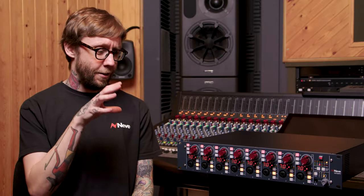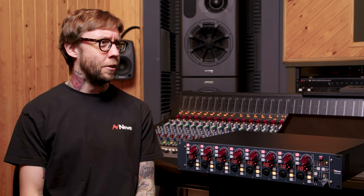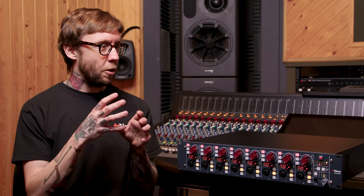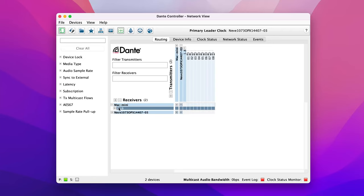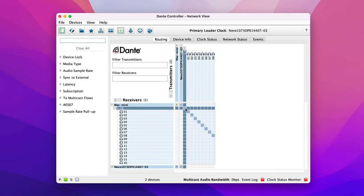The ability to place eight high-end preamps anywhere in your studio is going to be massively beneficial. Because Dante uses Ethernet cabling — your existing infrastructure in your building — you don't have to have many specialist cable installations to get this working. This means you can have essentially multiple OPX units connected through the Dante network, whereas with the USB ADAT card you're limited to up to 16 preamps through a single USB connection. With the Dante option installed, it's almost unlimited the amount of preamps you can have throughout your facility.